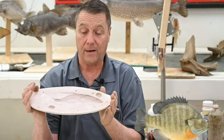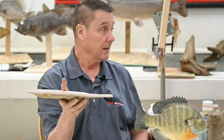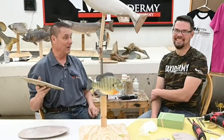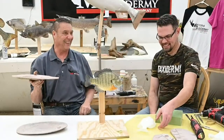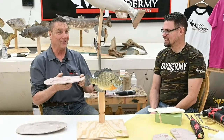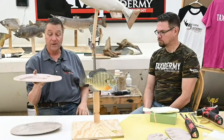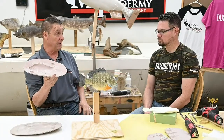Take it apart and you end up with a mold like this. Then it's time to make the part. Now we're into part two. Now to make the cast, most of the time we put on three, four, five coats of paste wax — we use part-all paste wax, just like Karate Kid. Wipe on, let it dry really well. If you're in a hurry, hit it with a hair dryer and buff it off. Three coats minimum. You want this fish to come out shiny.